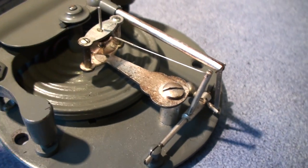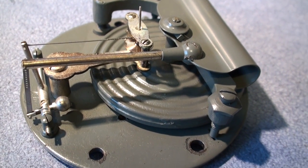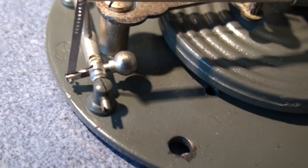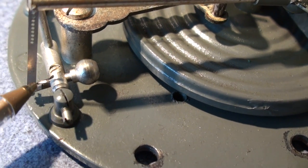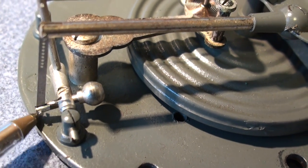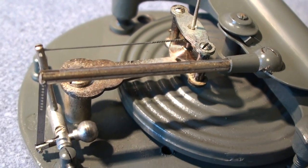This is a 1950s good quality movement. You have various adjustments for calibration when the unit is made. That screw there — loosen that screw and it adjusts the position of that bar through that axle point. Moving that inwards will increase the gain on the spindle at the end.